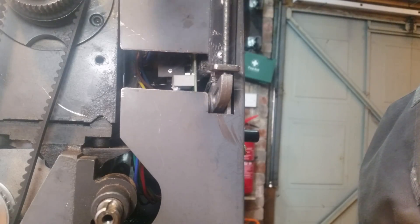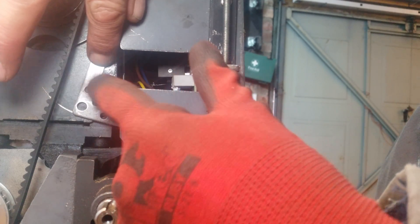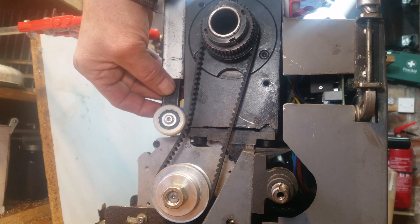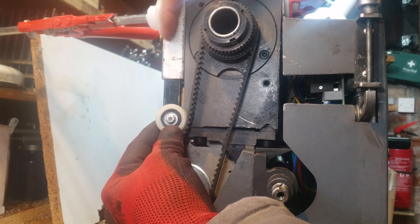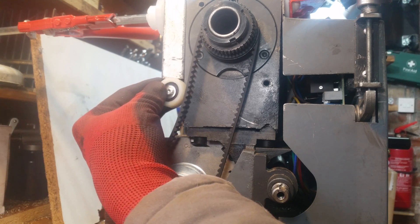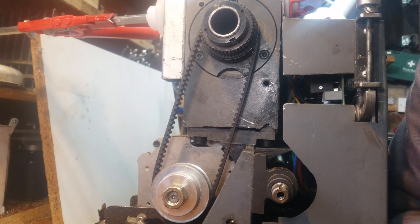We've had to have a change of plan. Our original plan of hinging off here simply wasn't going to work — there just wasn't room. You'd have the wheel on there, and then some kind of curved groove along there for a nut to travel along so we could get the right angle and bolt it in place, but there just wasn't enough room. So the new plan is to have a slider arrangement. I've mounted the wheel on the end of this bit of bar, slightly offset so the angles work. This is a bit of square section tube, about three inches long, and the idea is to have this sliding up and down — slides down to tension it, and slides up when you want to change the belt. The beauty of that is there are no long curved slots to be milled, which makes life considerably simpler.